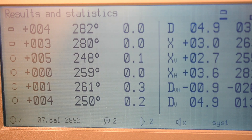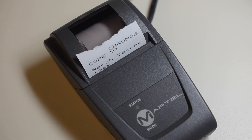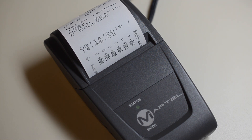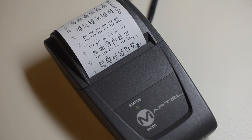After you've adjusted your dial-down position, check all positions of your watch. It is normal to see a drop in amplitude from the horizontal to vertical positions. We will explore precision timing in another video. Thanks for watching.